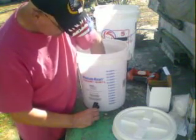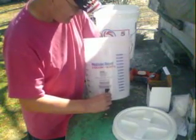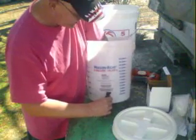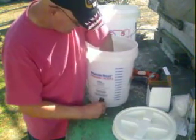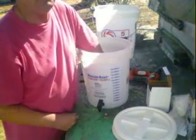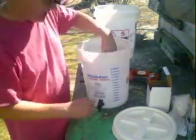You want to make sure that your faucet is straight up and down. You can adjust it later, but the best thing to do is go ahead and try the first time. You're going to hand tighten it and then 1/4 turn. Now on my water barrel, what I did is I put a coat of silicone on the outside and on the inside, then put my seals on.